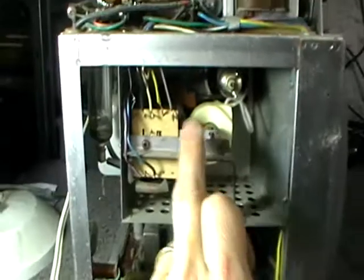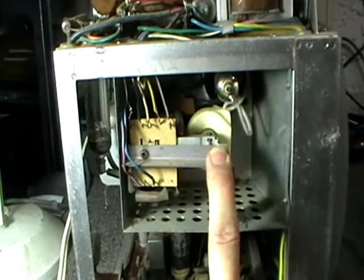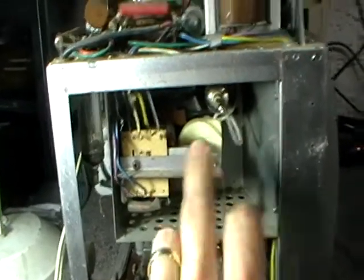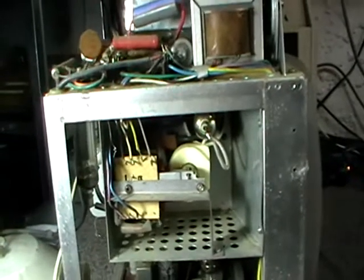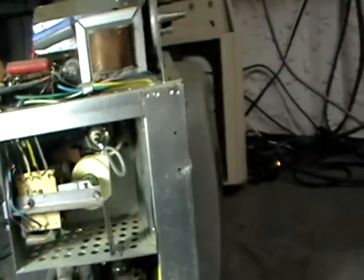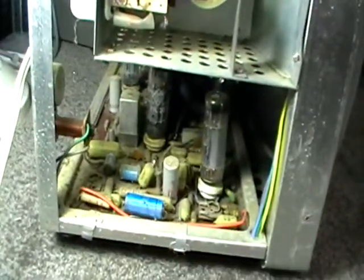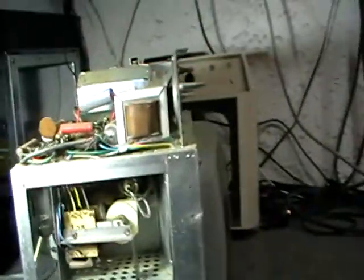The good thing is I have a box full of universal style lineup of transformers exactly like this, and they go in various makes and models of New Zealand sets. So when it comes to transformers, basically you just cut pins and add links to make them work. I've got a whole box of these, so should be okay for flybacks for a while, which is really good. Makes you feel like some of these old sets are worth doing if you can keep them going with other types of flybacks. It's really quite handy.